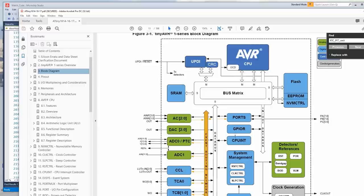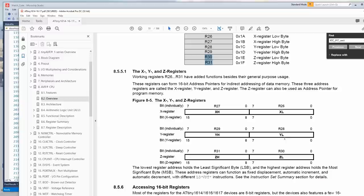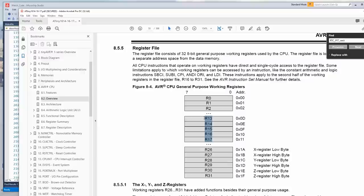Right, and then some of these actually work as 16-bit. So you see how you have a low byte and a high byte? Like that multiplication we were just talking about, it probably puts the result into two of these. See how they're arranged? I believe the Z80 also does that. So you can actually have some rudimentary 16-bit operations happening inside of an 8-bit CPU. Cool. These are basically being used judiciously by the compiler to save actual RAM.